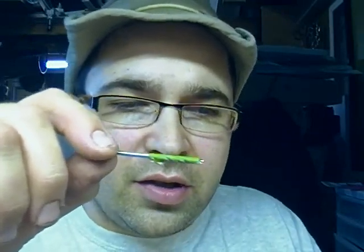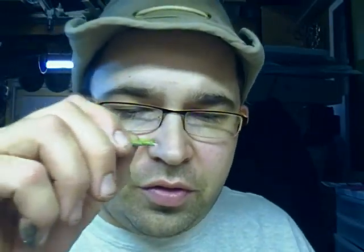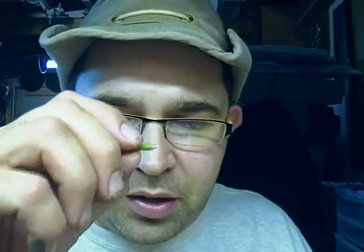You'll need a drill bit — two and a half millimeter, the size of the magnets. Even better, I use a three thirty-seconds bit, which is about a little better than a tenth of a millimeter under the size of the magnet. That way, when the drill wobbles and bores out the hole slightly larger than the bit, you'll get a nice snug fit.